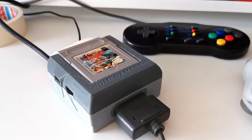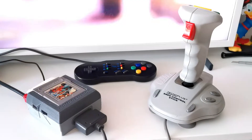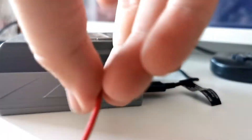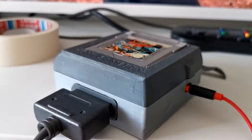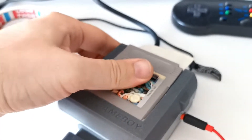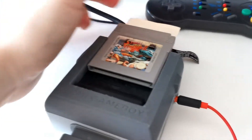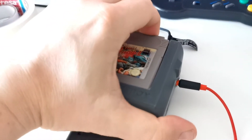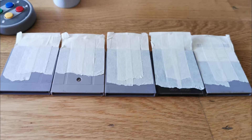The aesthetics of this kit are very unique, and if it was its main function, we would say it gets 10 out of 10. But, as we always do, we have to sacrifice a bit of beauty for better functionality. We also devised a workaround to prevent damaging the DMG motherboard during cartridge removal. The original DMG had a very hard case, which meant cartridges could be pressed against it. This housing is, however, rather soft — so this is what we came up with.